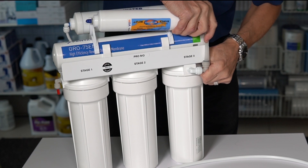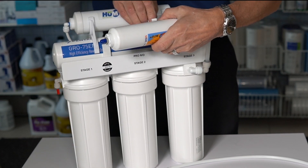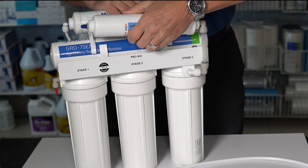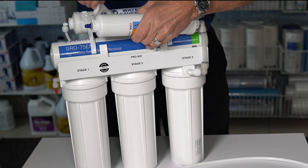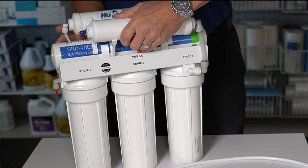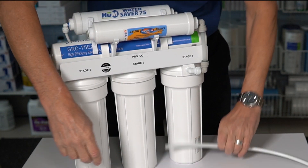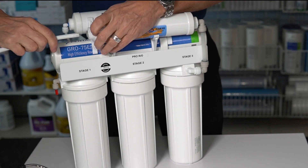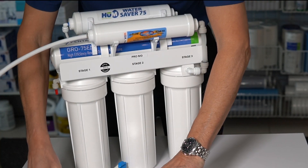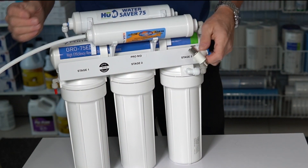On this end, you can put one of these clips on to hold it, and another clip for the other end. These are clipping right onto the membrane itself — put those two in. Then pull the stopper out of here, so now the faucet line gets connected over into here. Slide that in. Once you've connected that, make sure all the connections are tight.